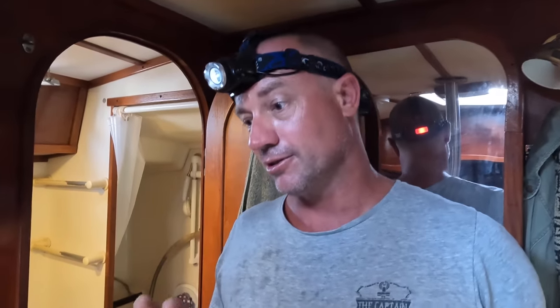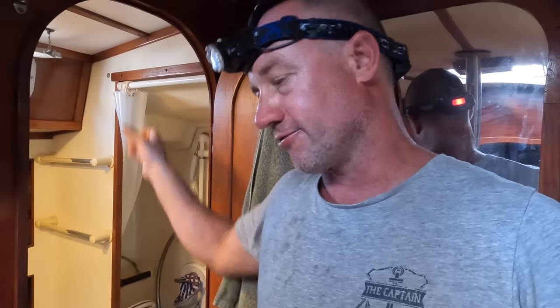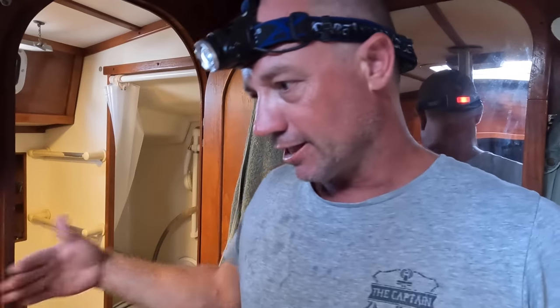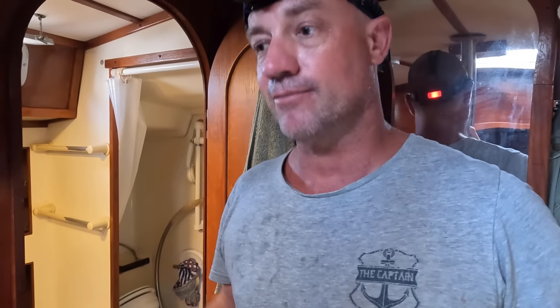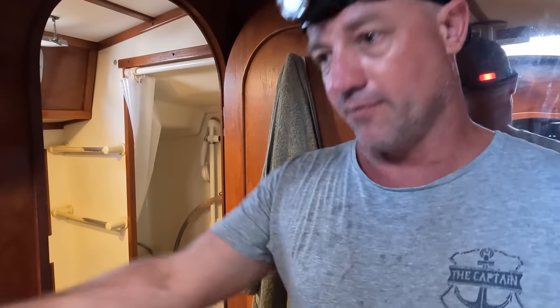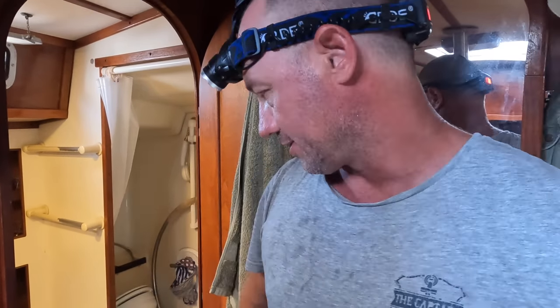So what I was going to do was cut into one of our scupper lines, our deck drains, and I just wasn't sure. I didn't want any aromas coming up through those lines, but I've found a little hole beside the bed where I can go straight from the toilet straight out. It's still a longer run than I'd like, but the through hole is there, and that's how it was originally connected. So it'll be a straight flat run as opposed to up and down all the way to the center of the boat and then back uphill. So I think it's going to work.